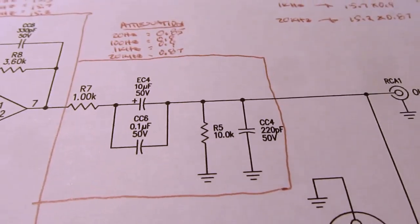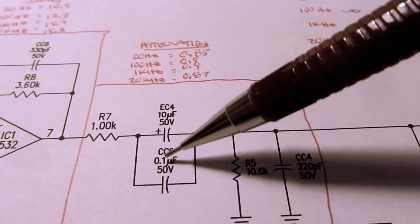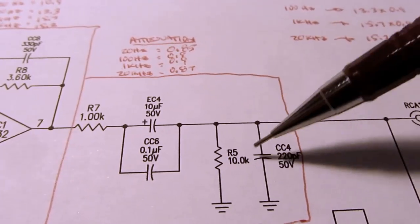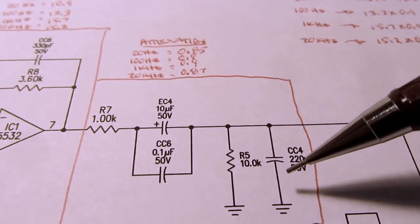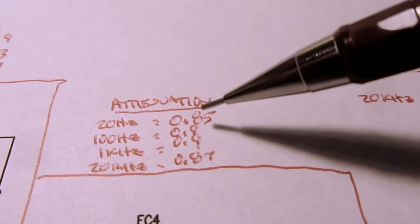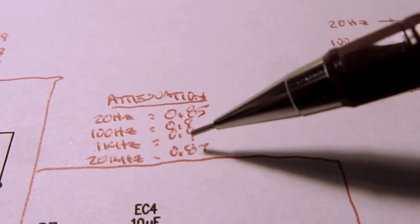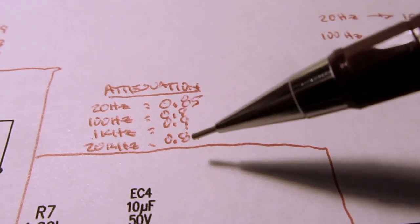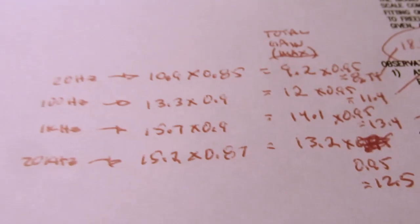And then finally, I had to do a similar set of calculations here, figure out the reactances here and what those would be in parallel, the reactance here and what that is in parallel with this, and then treat this whole thing like a voltage divider, and you have a factor or a ratio of 0.85 at 20 hertz, 0.9 at 100 hertz and 1 kilohertz, and 0.87, essentially 0.9 at 20 kilohertz. So if you add all those things up,